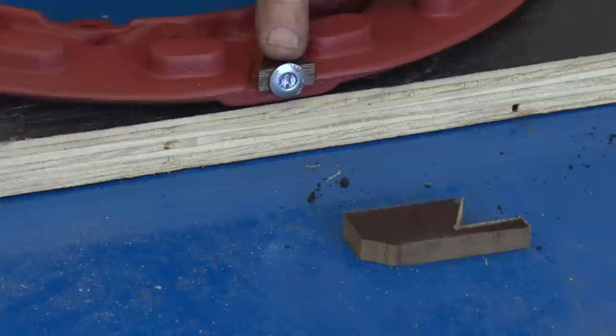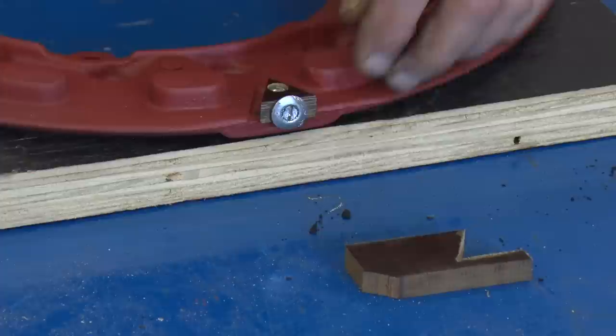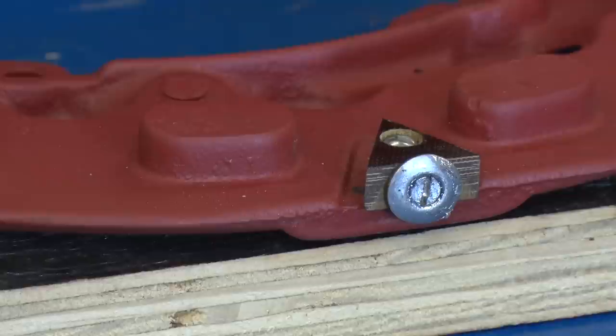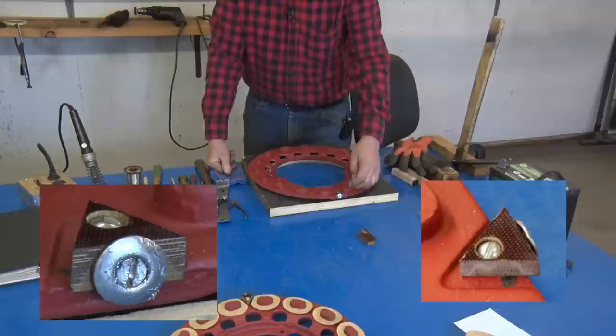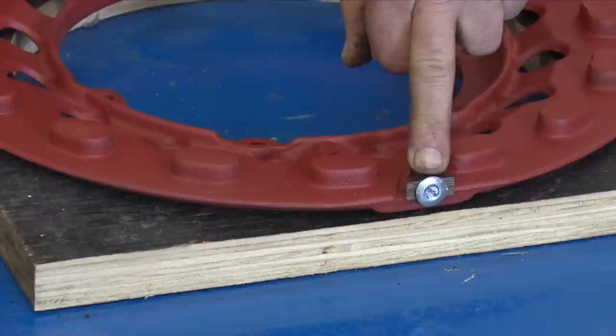Once you make the wedge, you can install it. You can drill a hole through this side here. That is a 6-32 hole. And usually the pickup button will be stuck onto the old coil. You can unsolder it and use it again in here. If not, you can use a washer. Any washer will work on that. Because you're using a flathead screw to attach it, I would countersink that washer so that the screw head will be flush. Okay. I would not install that until we get the coils on it.